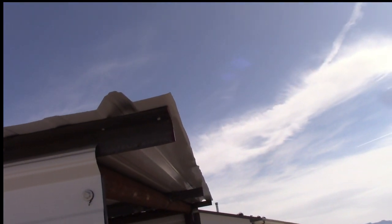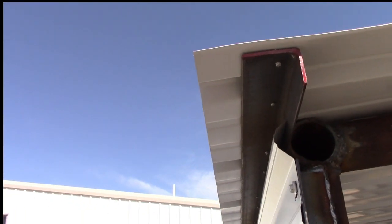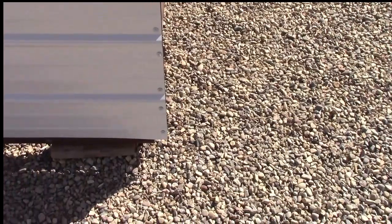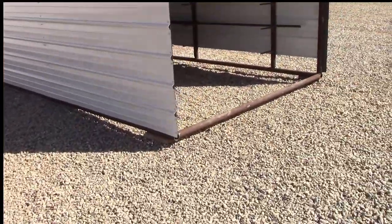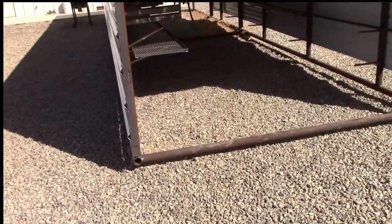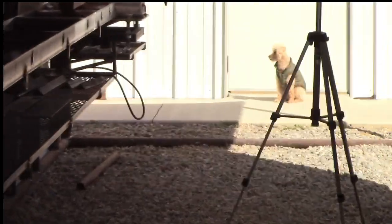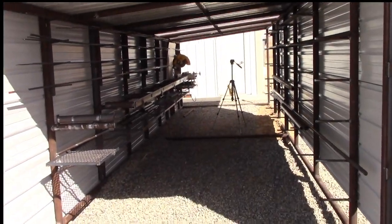Most of the time in tin work, they cover all that with a kind of a corner, but you can see the edge down there. There's no stair stepping. It's nice and square. About an 1/8 inch reveal on that tin work. So that come out really nice. Lined up with the shop. Oh, look. There's Brandy. She's soaking up some of the sun this morning. Gets really warm on that southern exposure shop in the wintertime.